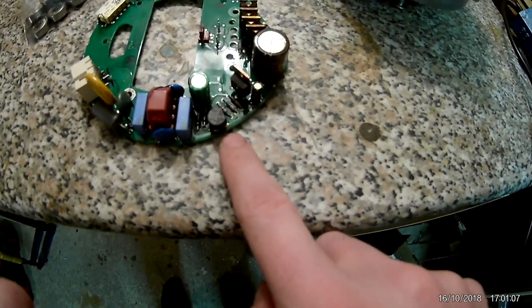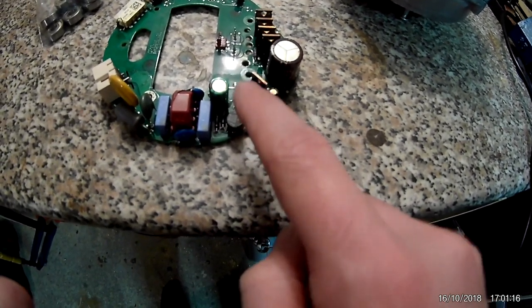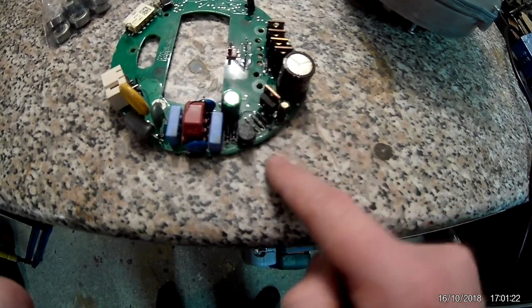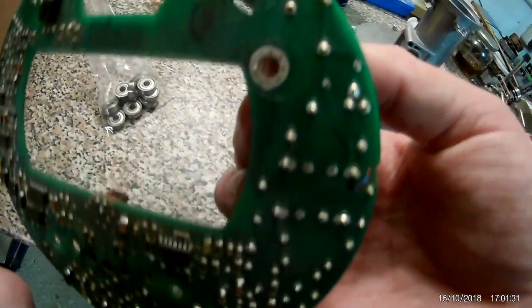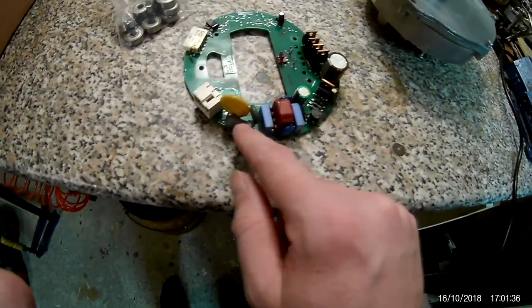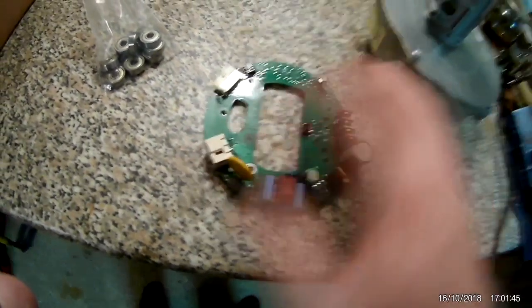It's probably a sine wave flipping up and down a voltage that somehow makes the motor move. In the worst case I can switch it myself using a microcontroller with an H-bridge. This thing obviously takes a lot of power — it switches directly 400 volts, or about 340V from this capacitor here. 400 volts, 47 microfarads, right next to the cap. There's high voltage up here and it goes probably through that rectifier there. That's a choke, and I guess that's a snubber network.